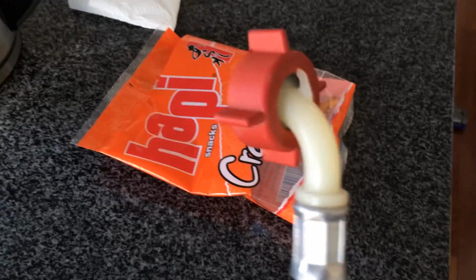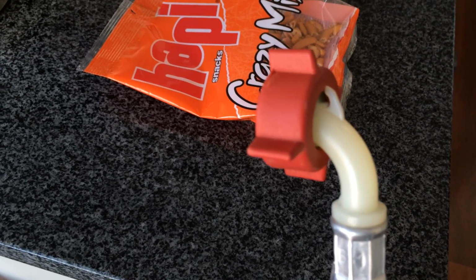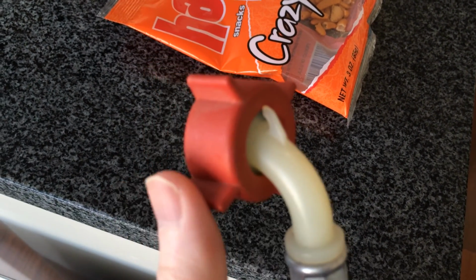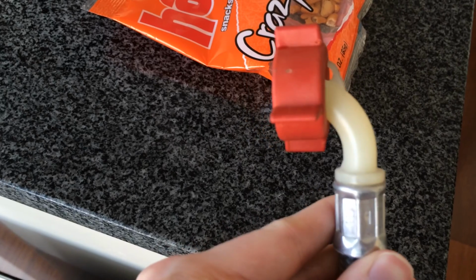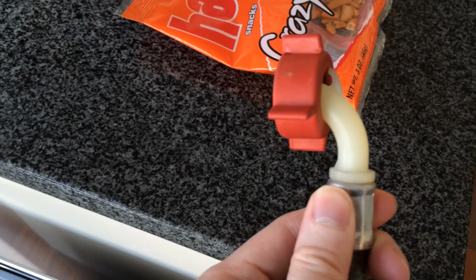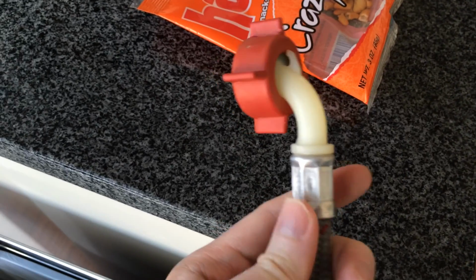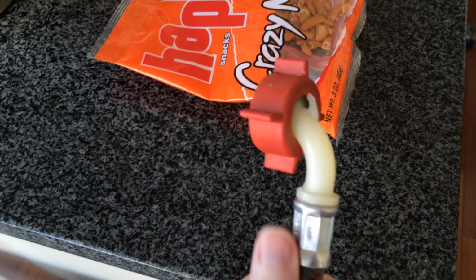Okay, I wanted to show you the other end of the hose that connects to the washing machine. This hose has the water temperature indicator on it. The other hose has a white screw-on nut, and this is an L connector, which makes it a little slimmer in terms of being able to seat back more flush against the wall. My replacement steel hoses are just steel reinforced hoses without this connector and without this L. So they're perfectly fine, and they are steel reinforced. That's probably the main thing you want in a hose, and this L stuff is nice, but it doesn't really matter that much.